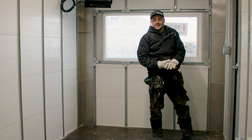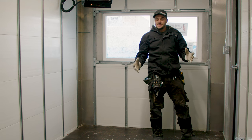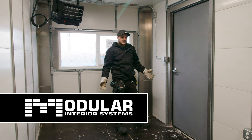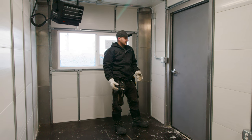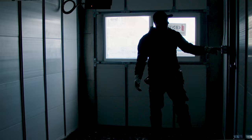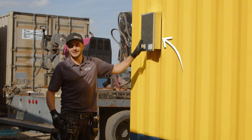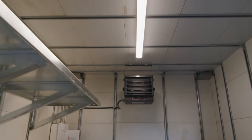This container is fully electrified. We achieved that by framing it with our modular interior systems using CSM brackets that allow us to strut-line the entire interior. This is very different from steel studding or wood studding the interior — it gives us a fully modular interior where we can mount our switches, plugs, heaters, and everything else. Our electricians can pipe in and run EMT anywhere to anything.